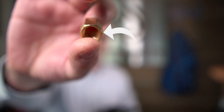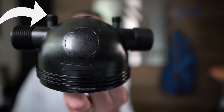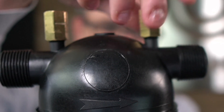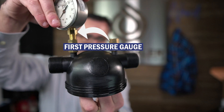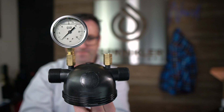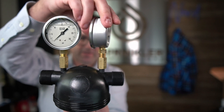Now that we're back and I'm at my desk, I have all the parts here and I'm going to go ahead and put it together for you. Here is a close-up of the quarter-inch by quarter-inch female brass coupling and we're just going to mount it right on the top of the filter. We'll screw on coupler number one, then coupler number two, then we're going to take our first pressure gauge on the upstream side and screw it on — doing this loose for now; in the field you would crank these down pretty tight. There is pressure gauge number one on the upstream side, then we're going to mount number two on the downstream side.